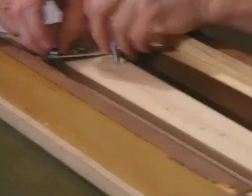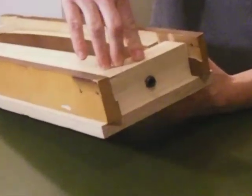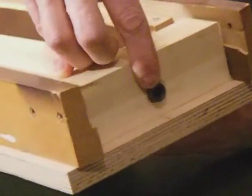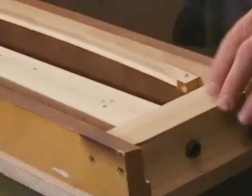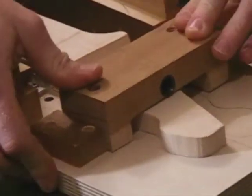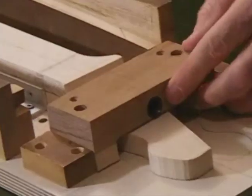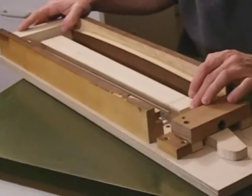I have an end block here. This end block is set up for my heel drill hole and it is at a 2.8-degree angle already to accept the bit. I have template bushings — an insert for a 3/8 and an insert for a 3/16 drill bit — to guide the drill bit through, and that can be moved around and taken off if needed. At the headstock side I have a second block that gives my 3-degree angle, and I use an insert for the 3/8 bit and a 3/16 bit to do my hole for the headstock plug.